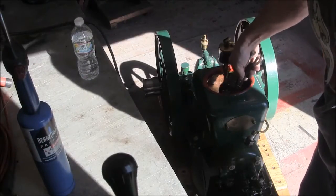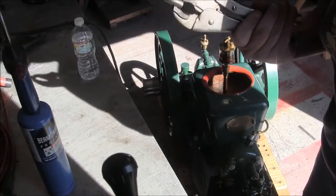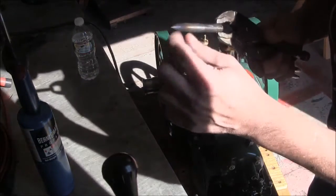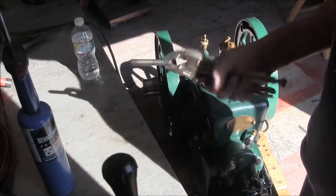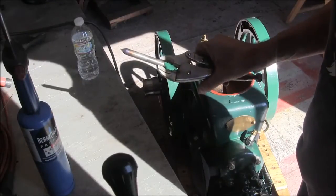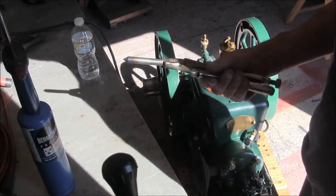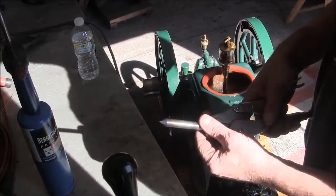First part of that was hardening, second part was tempering. I think I went a little blue, but it's alright. So that should hold up a lot better than the soft state. This was 1018. You know, like I said, just a pointer I use to center up on center punches in the mill. So hopefully that'll last a little longer than the soft version of it.